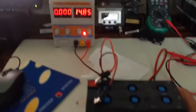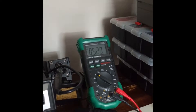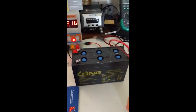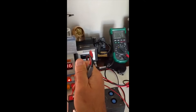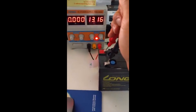I might give it another 5 minutes, pull the leads off and take another voltage reading. It's been another 10-15 minutes — it's still not taking any current, so that's not a good sign. This battery is going to the junk. I guess it was worth a shot. Maybe I'll keep the charger on overnight. It's been overnight — still doesn't seem to be drawing any current. It's reading 8.6 volts. That's an improvement, but I don't think it's ever gonna reach 12 volts. It's dropping very slightly, so I'm gonna have to get rid of this. It's not gonna be usable in the UPS — so that's about it. Time for the junker.